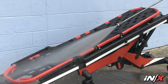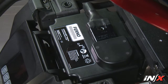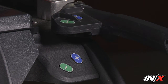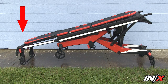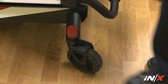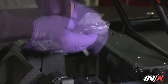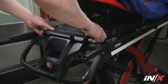It's possible to power wash the NX, but care should be taken against forcing water into the control panel and cables. To prepare the NX, remove the pad and any accessories. Raise or lower the NX to the recommended transport height. Use the direct power mode to lower the loading end of the NX and the loading wheels to the ground. Turn the power switch off and engage the wheel locks. Remove the battery cover and battery from the NX, cover the end of the battery cable with a plastic bag, and use a tie wrap or rubber band to make sure the bag is watertight. Put the battery cover back in place.